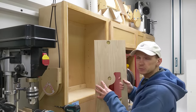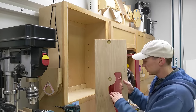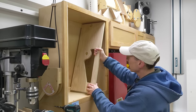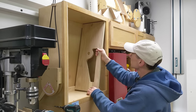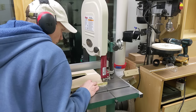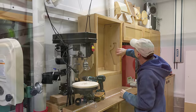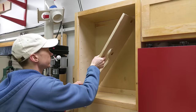This is the first base plate for the lift mechanism. It's got the two pivot points for the four-bar linkage and the cutout where the gas spring is going to live. That fits inside the cabinet, except I forgot to account for this strip of plywood and this strip of plywood in the back of the cabinet, so it doesn't quite fit yet, but I can knock those off on the bandsaw. I also cut out the left side, which is just an exact mirror image of the right.